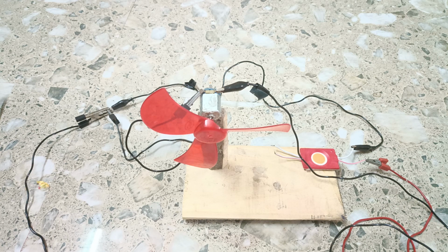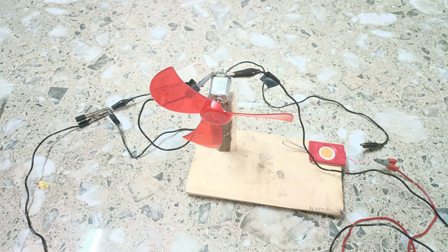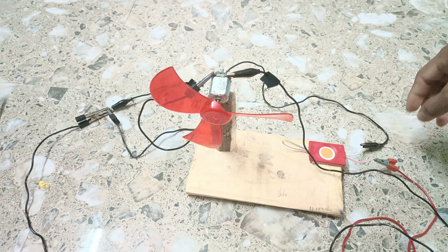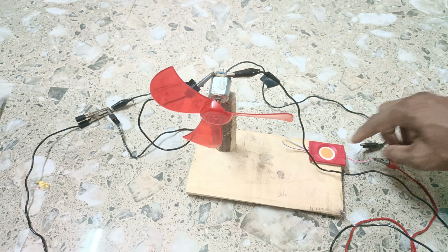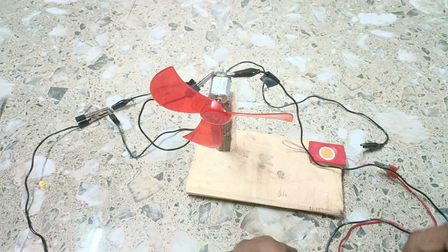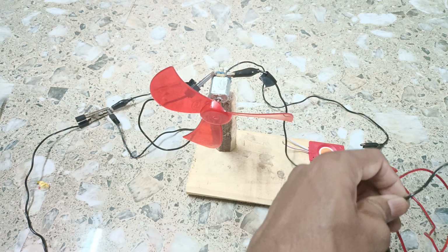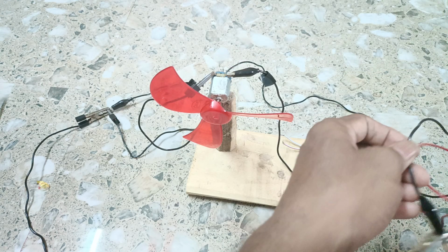Can you see how we connected this motor and the light in parallel connection? I am showing you how to connect this one again. Here, see, this is the positive terminal of this LED. The positive terminal is connected, and we connect one terminal of the motor and make a junction here,